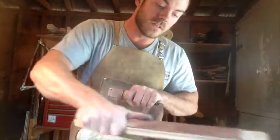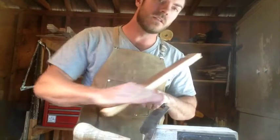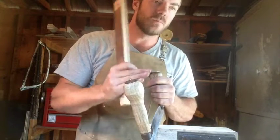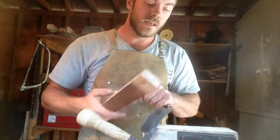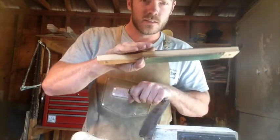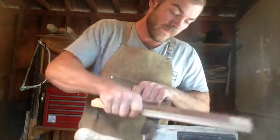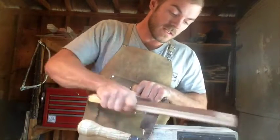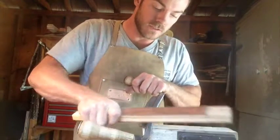And what this does primarily is as you're sharpening with a stone pushing into the blade, you go back and forth and back and forth generally on a blade, and you're always kind of pushing this little microscopic wire back and forth that doesn't quite give you the sharpest edge you can have. The leather, because it's soft, will actually kind of slightly bend over the edge a little bit. And the more you rub on it, the more it takes away that little wire all along the edge. And the honing compound also helps to give your edge a really nice polish.